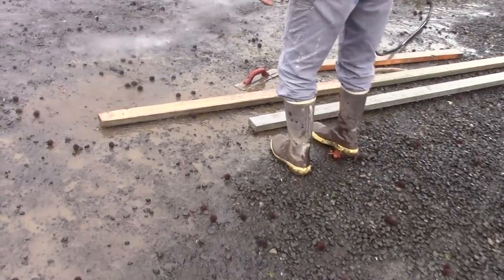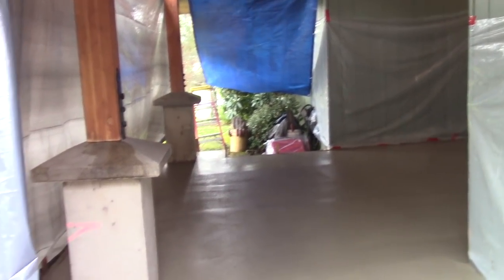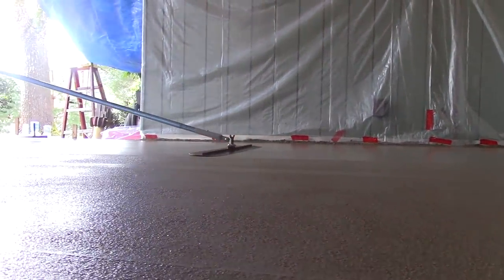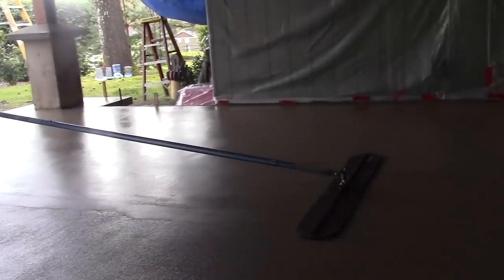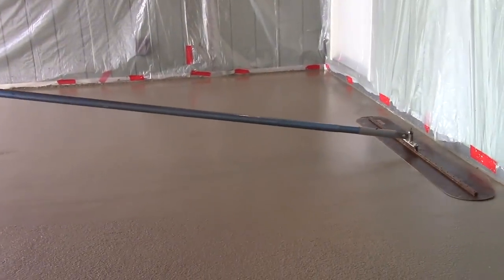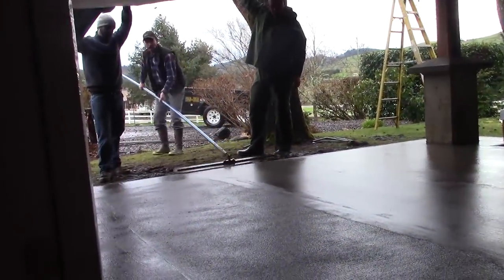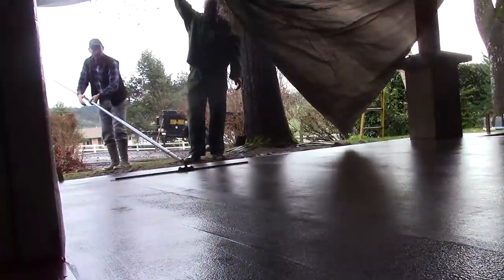Can't beat that. Forming concrete, setting up concrete, is carpentry, isn't it? It has much more in common with framing than pouring. And if you have the tools and you can build things and you understand the slopes that you need to move the water off of your concrete, if you understand the strength that it will need to have to withstand the hydraulic form pressures that will be generated, if you understand the timing of removing the forms and how that will work, go ahead and set it up.